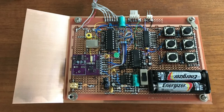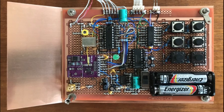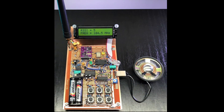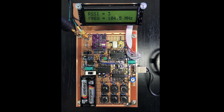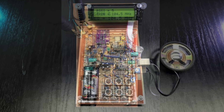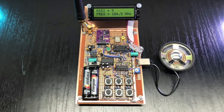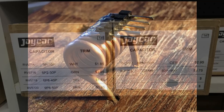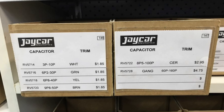That was the last time the serial transceiver was actually used as a serial port, because I've since used a 5V LCD module that needs the voltage multiplier in the MAX232 as a power supply, and also the negative voltage it provides for the contrast adjustment pin. And an antenna tuner, since the radio will be used on multiple bands, using this multi-tapped inductor and some trim pots from Jaycar Electronics.